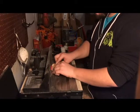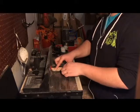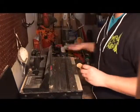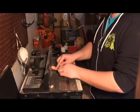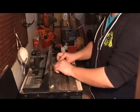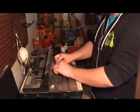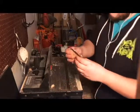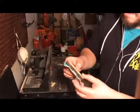And when using a router bit with a router template for a fingerboard, it's very important to do gradual but confident movements with the board against the bit. This is true with both the popsicle shapes and cruiser shapes alike. It's very important to be cautious, be mindful, but be deliberate about what you're doing, because the bit can very easily grab into the material you're working with and pull it out of your hands if you don't have a very confident and certain grip.